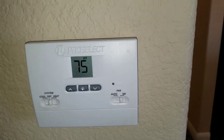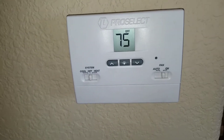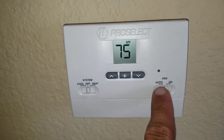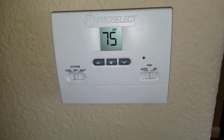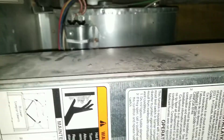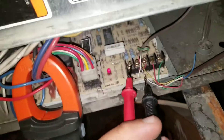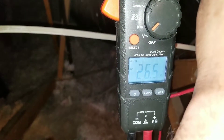I'm going to switch this over to on. Whenever you turn your thermostat to the on position, you're basically just using it as a regular fan — it's just continuously recirculating the ambient air in the home. When you put your thermostat to auto cool, that's when it regulates the temperature inside. But if you put your thermostat to the on position, you're simply running the fan. You can see my fan motor is running, and I'm going to tap the common lead and my green lead — I should get a reading of 24 volts. And you can see I'm at 26.5.